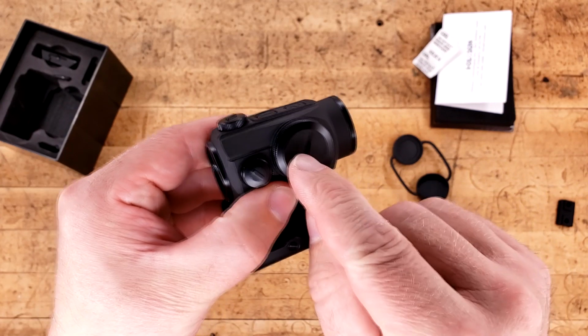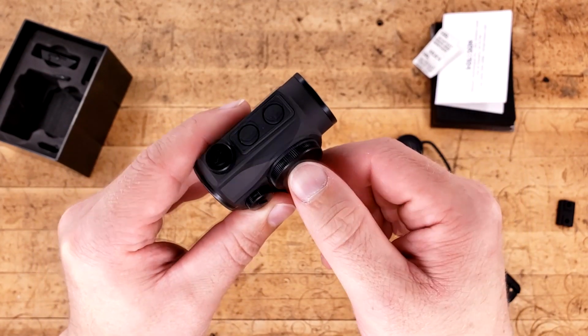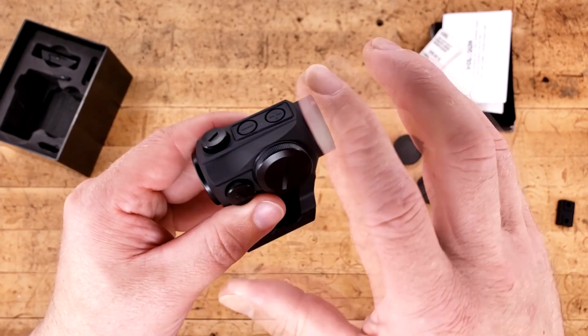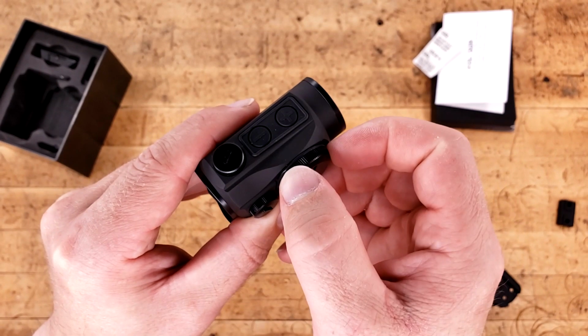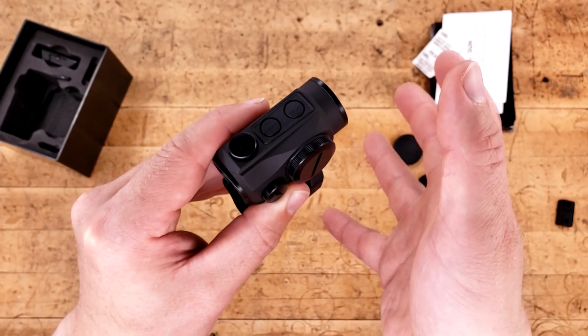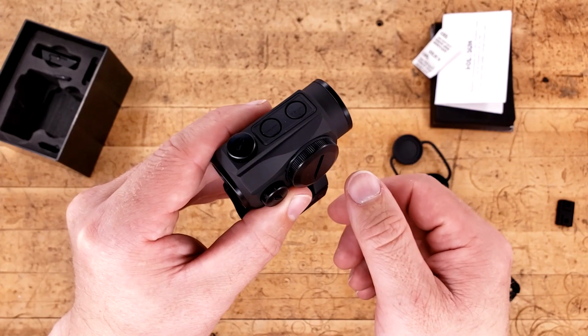It's just putting square pressure up against it, and rubber on aluminum backed with more aluminum, especially with a decent anodizing like this, it's not really going to slide all too well. You're putting a lot of pressure on that O-ring every time you go to tension this because you're having a large friction surface area, and you might rip that O-ring over time.